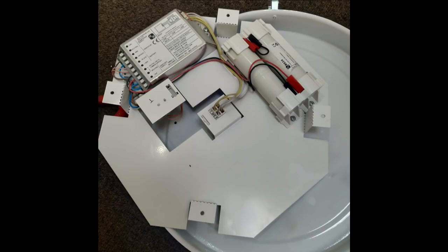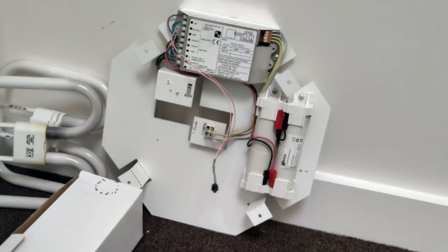So these light fittings really are a load of old junk. Absolutely ridiculous. Once the batteries fail, basically the entire light fitting is scrap. Now in the case of these ones, what we're actually doing is taking them down, throwing the whole innards away because several of them have failed — and not just for the batteries, several of them have actually failed for the normal mains powered part as well. And then we're simply putting a whole new tray into the existing housing, and that's actually an LED one of course because far less power is used and it's considerably more reliable.